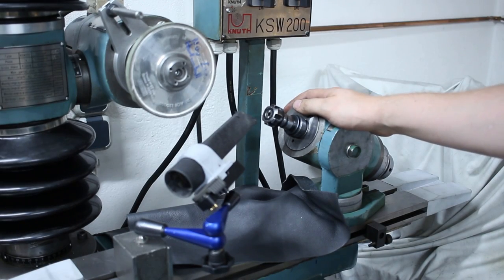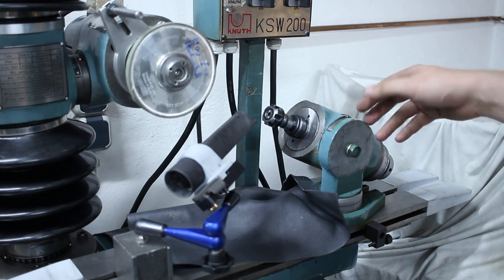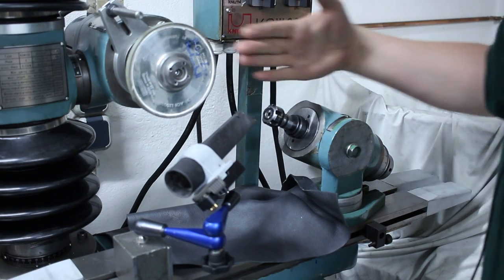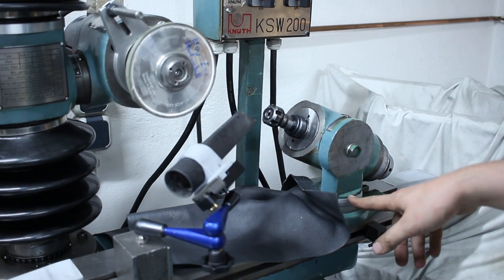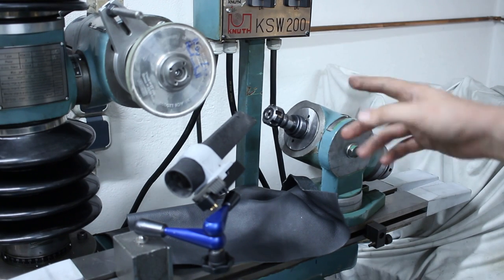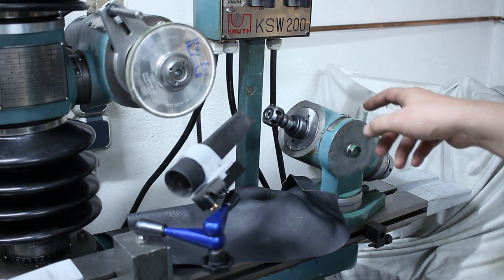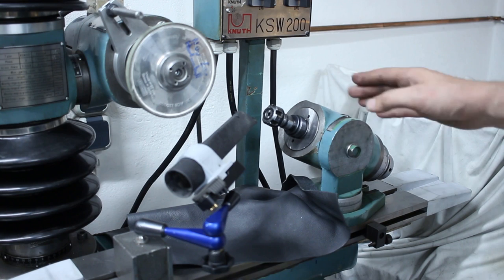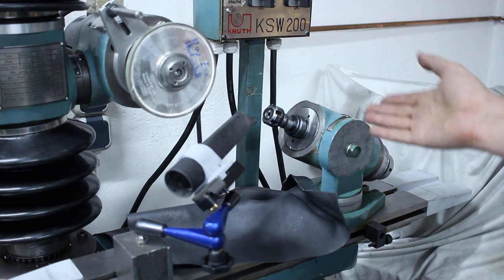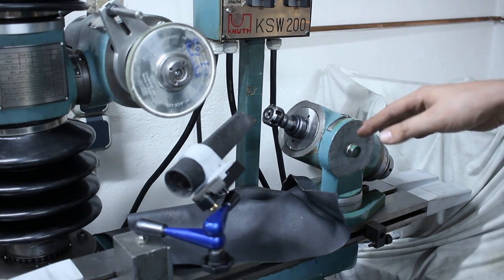Okay, that's the setup here in the tool and cutter grinder. I have the standard spin fixture or dividing head here. It's aligned in this direction with the travel of the table, so it's set to 0 degrees. And it's tilted back by 28 degrees. I'm not sure about the back angle that usually is used for thinning the web, but that's currently the most back angle I can get. A little bit more would probably be nice, something like 35 or 40 degrees.